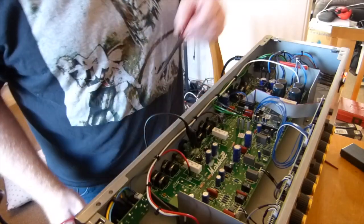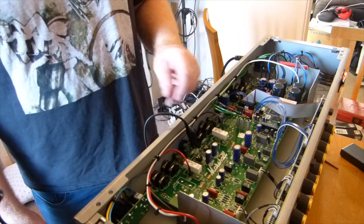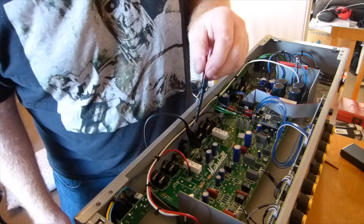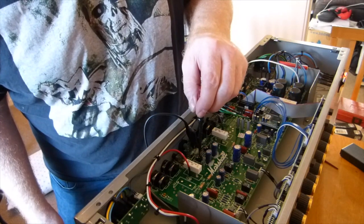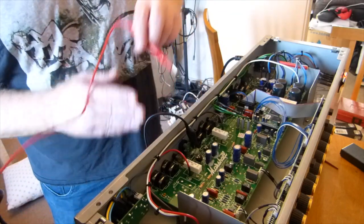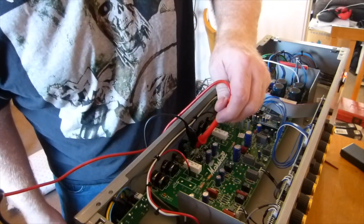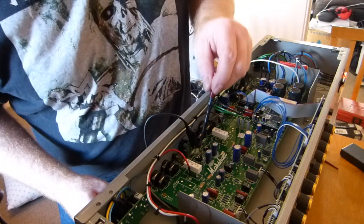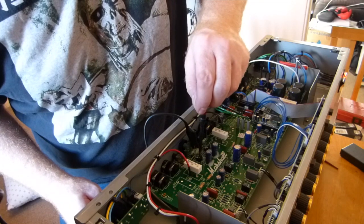I had a DSL 50 watt head before. A lot easier because the biasing probes were on the back of the amp. You didn't even have to take the chassis out. However, with those, the trim pots affected each other. So if you went down with one, the other one went up, and vice versa. So it was quite a balancing act to get those to match. These just seem to affect one side or the other singularly.